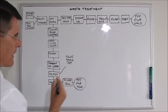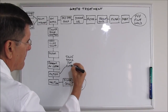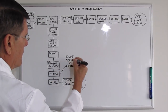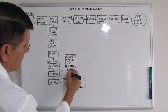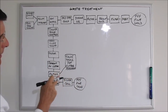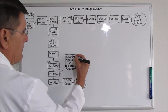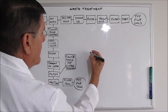In my silver stock pot, it's full of copper — copper wire, copper fittings, any kind of copper. What happens is any precious metals left in solution will cement out as a fine black powder and fall to the bottom of the stock pot. Once I'm certain that all the precious metals have cemented out of the solution, I transfer this solution to a waste bucket.